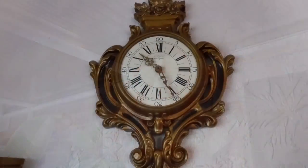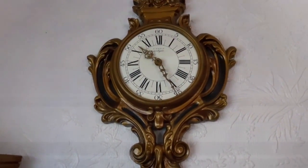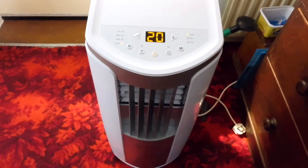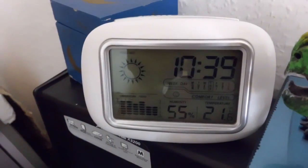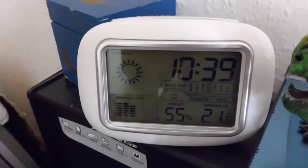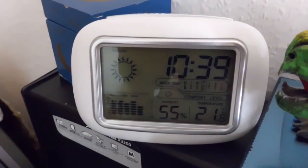I've pegged up a tablecloth to stop the hot air going back inside the house. Since this is only a rare occasion of an extremely hot day, I thought I'd do this as an experiment. It's now coming up to half past 10 and the temperature outside has gone up to 28.6 degrees. The temperature in the living room is 25, aircon is set to 20, and the temperature in the room where the air conditioner is is 21 degrees. So you can say it is definitely controlling the temperature.